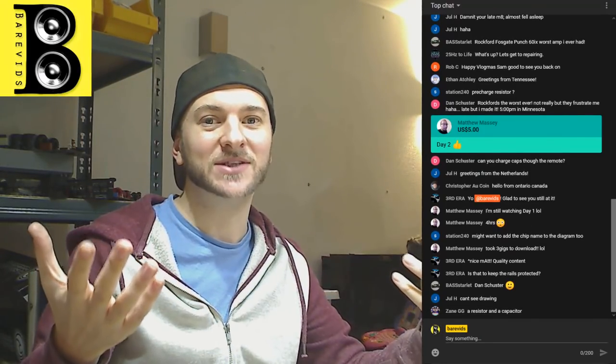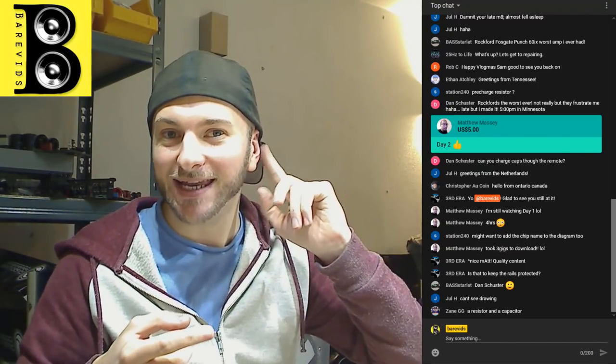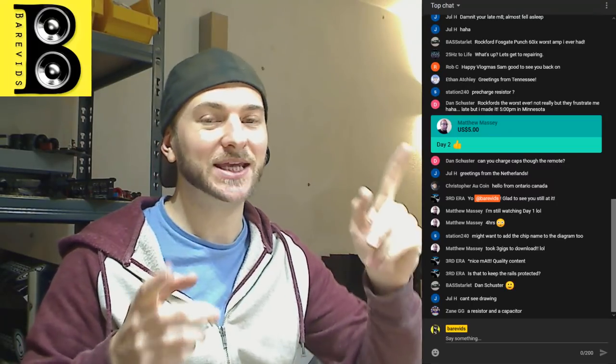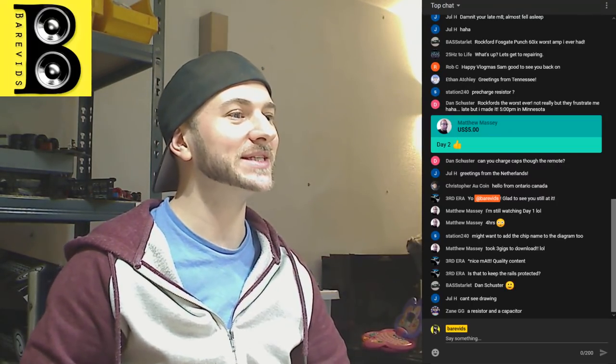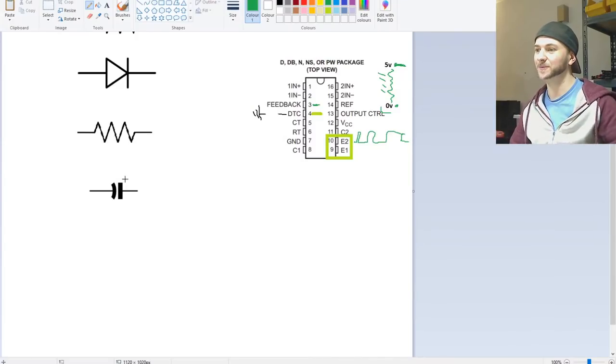and you'll have 5, 4, 3, 2, 1 until the capacitor is empty. And that's exactly what we want. We want pin number 4 to listen to that voltage. That's important to know. So the way that we're going to set this up is like this. I'm going to draw the little circuit diagram now to explain how this is going to work.